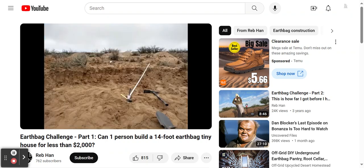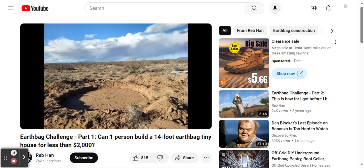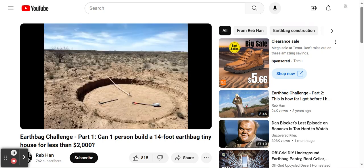I want the floor of the building to be between 2 and 3 feet below ground, so I'm going to dig out the circle. Once the earth was removed from the circle, I still had to hand-sculpt the circle's edges, and then try to make the inside floor as level as possible. Also, I dug out another several inches around the interior edge of the circle. This will allow the first layer of earthbags to sit in a sort of pocket, giving the first layer a bit more stability.